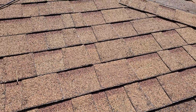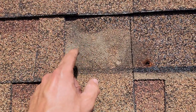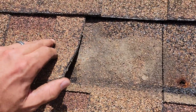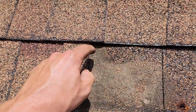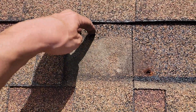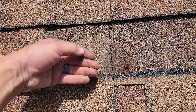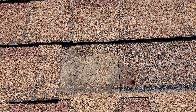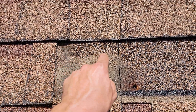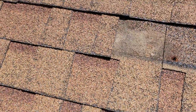Actually, not close — I'll put a tape measure on it. I'm trying to avoid showing you the water trail, but you can see it coming in where the two shingles join right here. Water will get into those — the underlying side of the shingle below is there to protect it and eventually run it out. That's also why you don't want a solid line of seal strip, because it channels water. The lower the slope, the more the issue. You can clearly see the dirty water trail coming over. Let me get a tape measure.